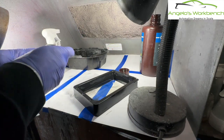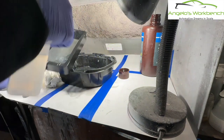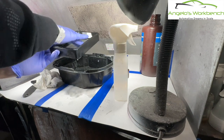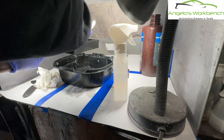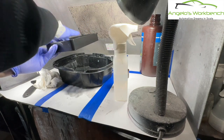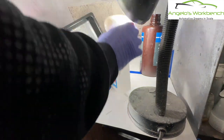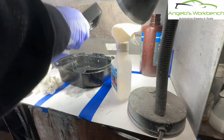But this is garbage. Now what we'll do is spray this with some alcohol. I'll go in with my finger and wipe the FEP screen, because it is fragile — you don't want to scratch your FEP. They say you replace it about every bottle of resin or so. Every time you use a whole bottle of resin, you'd change the FEP. They're relatively easy to change — there are some screws here, it comes off, you put the new one on and you're done.